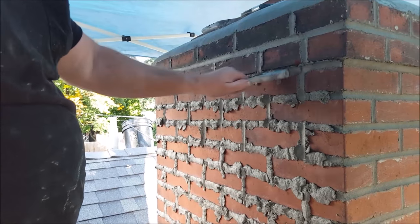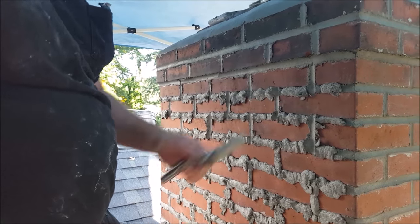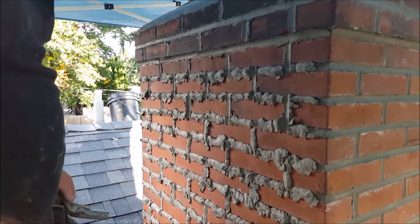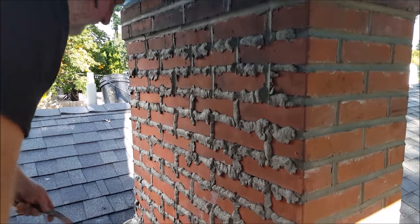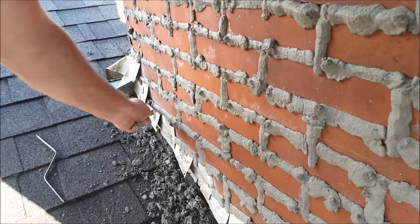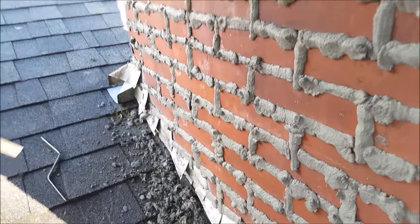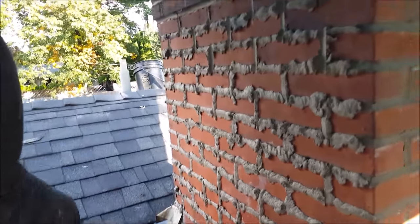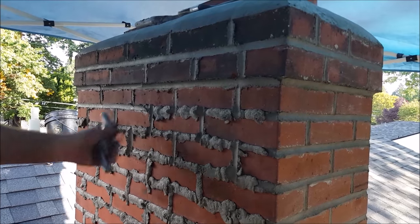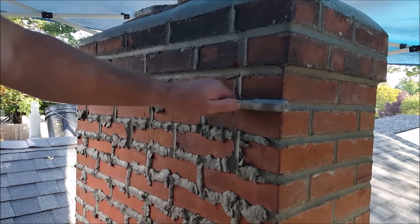On this job we're using a concave striker — sometimes they have a flat strike finish. This is concave and round; this is flat. We use the flat striker, as you'll notice down here at the flashing. I was able with the grout bag to squirt mortar back behind there and use a flat striker to reach back in and strike that joint. You can't do it with a round one. Nobody's going to see it anyway — it'll look fine. I started from the corner and came in. See how the mud's falling off nicely? I'm striking at just the right time.